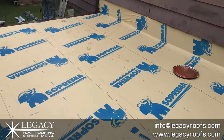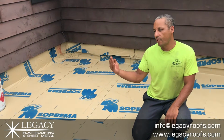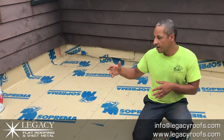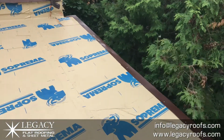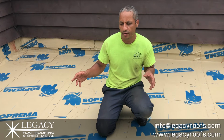Same detail back here. We had to make sure in the middle of winter that ice and snow doesn't build up there. Now we have the base sheet running up the walls. Before, there was nothing there. It was just fiberboard. Now it's fully waterproof. We have a drip flashing around the outside. This deck is beautifully tapered.